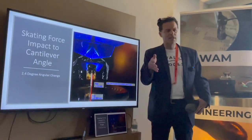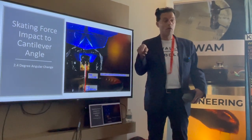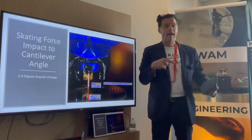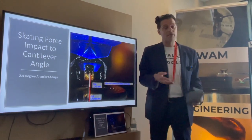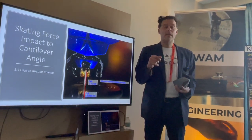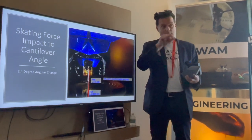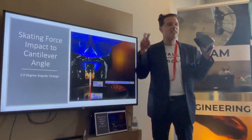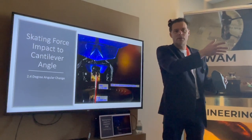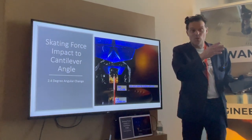I put those on the Wally Skater first as well before I aligned the cartridge, because I want to know that the tone arm wire or any other function isn't pushing that assembly one way or the other. And in one case, on a very expensive pivot tangential tracker, I found that the force being applied by the tone arm wire was off the Wally Skater scales. It's no longer accurate at a certain point. I don't care about that because I only care about anything like 12% or below.